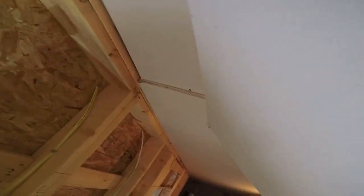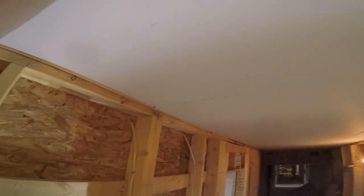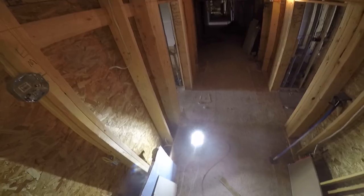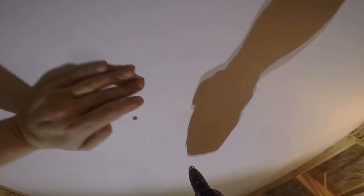When you're putting on lids, always be facing the butt joint — facing the wall you're going into. Your partner and you should be looking in the same direction. Always be on the white side of the board, never the brown side. If you put yourself on the brown side, that puts you between the board and the wall or ceiling. You need to be in sync with your partner — it's very important, you can really hurt each other if you're not.